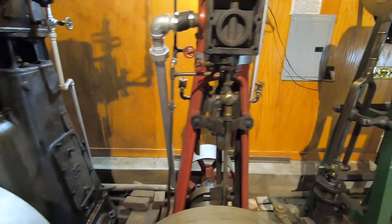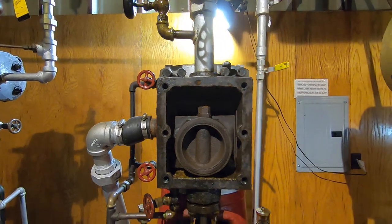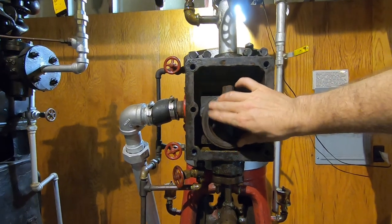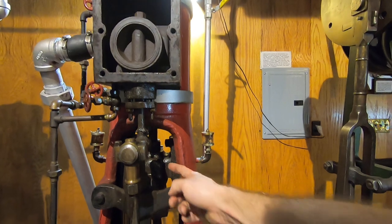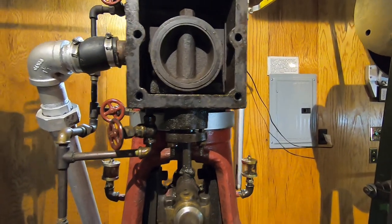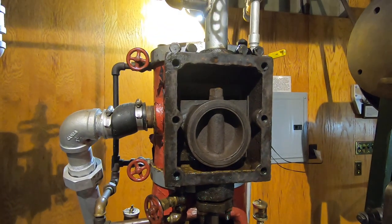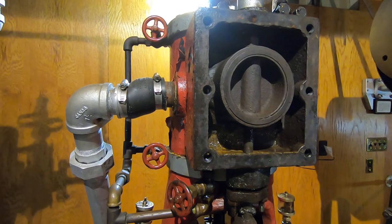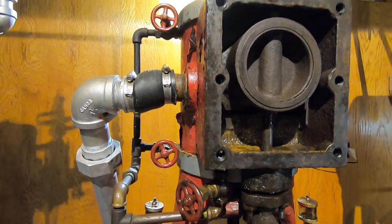Something very similar on our Sears and Roebuck engine here — the Kenmore engine. You can see there's a slot that's exposed at the top here, and again our steam chest fills this cavity. This casting is nothing more than a pressure plate to keep it tight against the inside of the cover. As we rotate the engine, you'll see the crosshead — the piece here — connected to the piston inside and the connecting rod down to the crankshaft begin to move. The piston is now close to top dead center and it's letting steam into the top side of the cylinder from the steam chest through that slot. As we come up past top dead center, that position reverses, and now the valve is connecting that top end to the exhaust to let it vent.